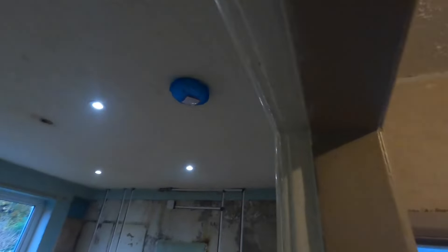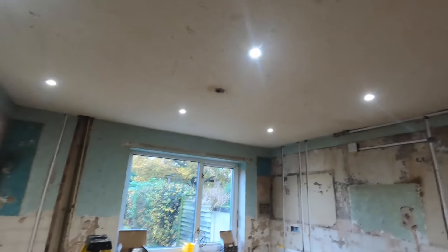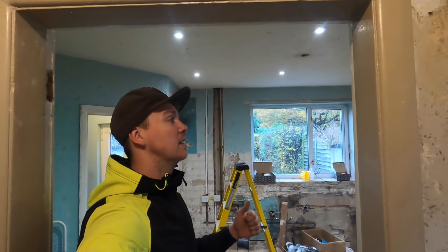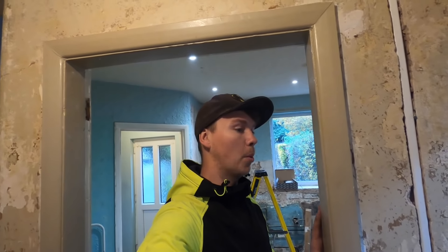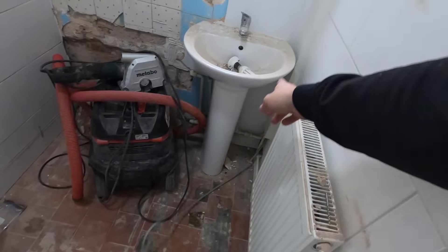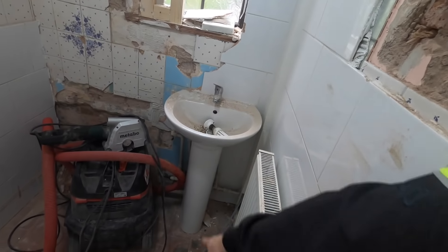We've got a smoke alarm up here and a heat alarm in here — 300mm away from the wall, I think that's the regulation. We've got six spots. The kitchen will become live very shortly once I've done my dead tests on it. It was very late last night; we managed to get the lighting circuit tested the way we wanted and powered it up, so we actually had some light while packing up. Utility room — there's a socket there, but it's not going live yet. It'll go in a WAGO box. There's a cupboard going in, a big vanity unit, a washing machine, and a sink on top, so the socket will go underneath the sink unit. We've got a 2D fitting up here as well.